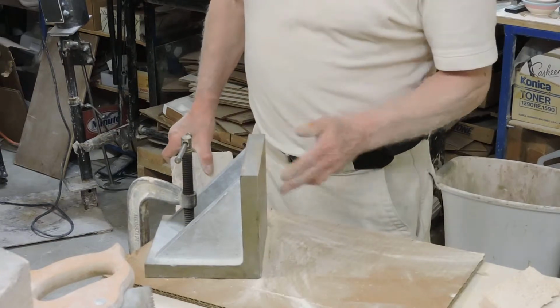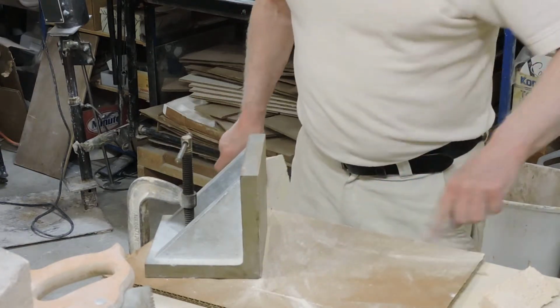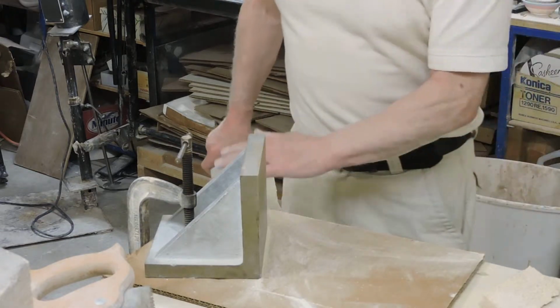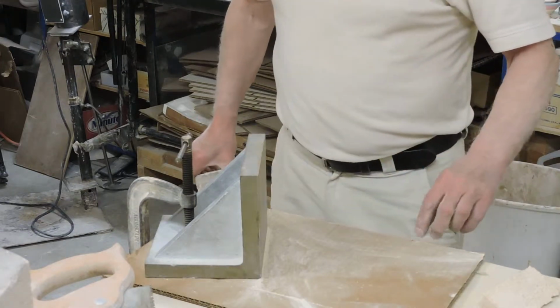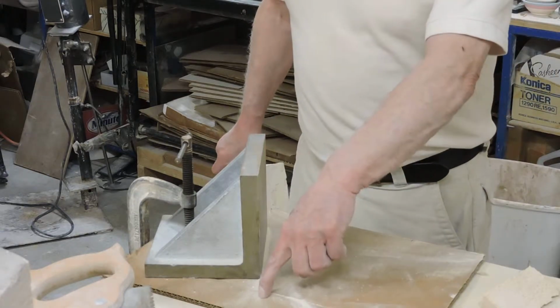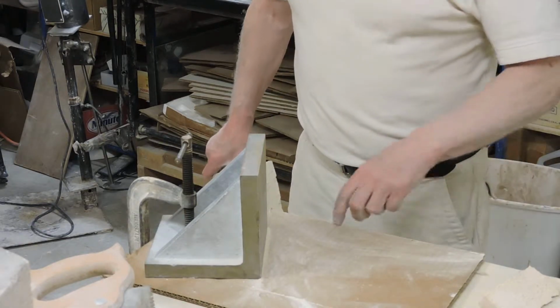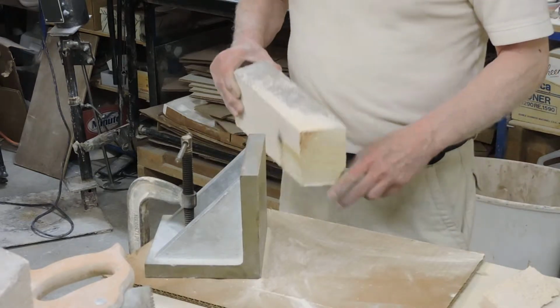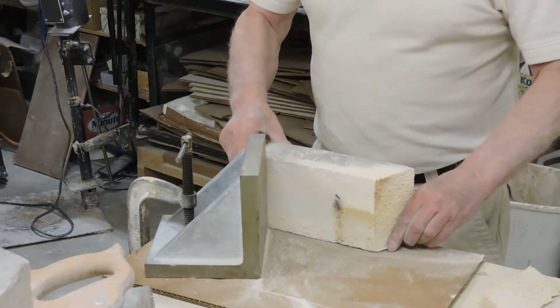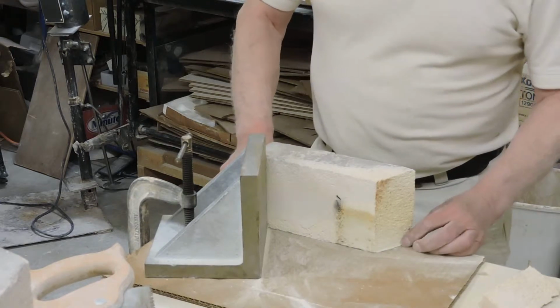Now I want the brick to have a particular angle, and the angle happens to be drawn in here. I used trigonometry to calculate the exact angle by laying out the tangent lines so that I had this distance, and this was the rise and that was the run, and it wound up giving me a precise angle that you couldn't have generated with a protractor, but you can generate it with trigonometry easily.